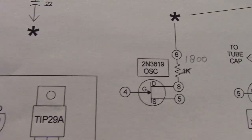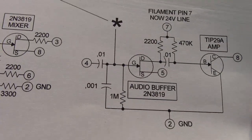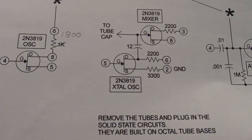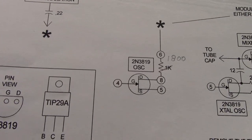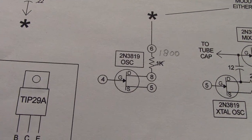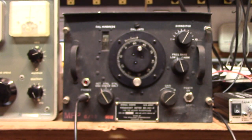Going up the scale with the oscillator it would start to oscillate at a lower voltage — so that's the critical part. That's the mixer and crystal oscillator for the 1000 kc crystal, and this is the module for the audio output. It all works. Fortunately the FETs have a very high impedance gate, so it doesn't load the tank circuit very much. But you do have a low impedance on the drain and source, and that is what you have to be careful about. That may be the reason that some weren't able to transistorize these things and make them work properly calibrated.